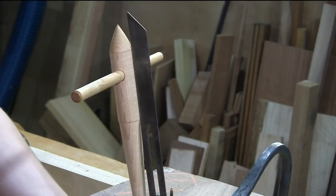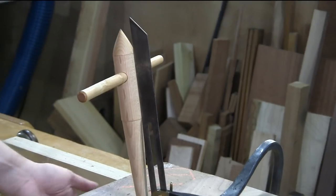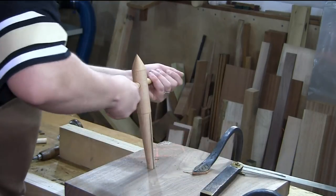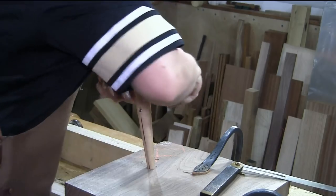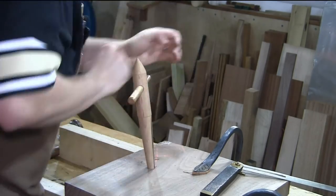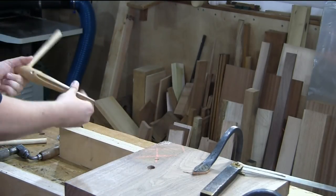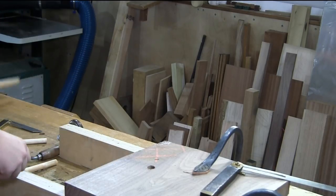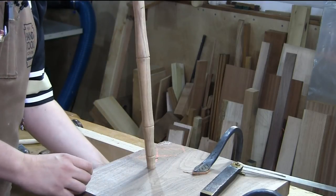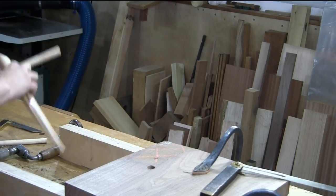I've got probably 2 to 3 inches of the reamer sticking out on the underside of the blank here. So it's firmly registered. It's really not going to go anywhere. It doesn't mean just be careless. If you are focusing your pressure straight down, it shouldn't be deviating dramatically, but you know, just keep that bevel gauge nearby. Cut maybe another quarter inch or so.